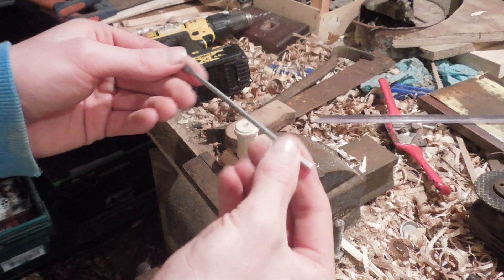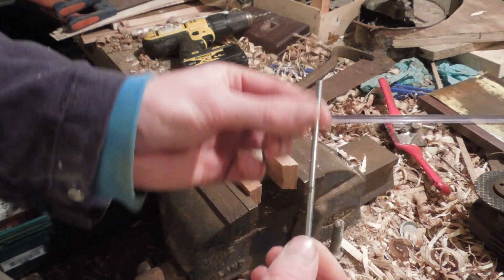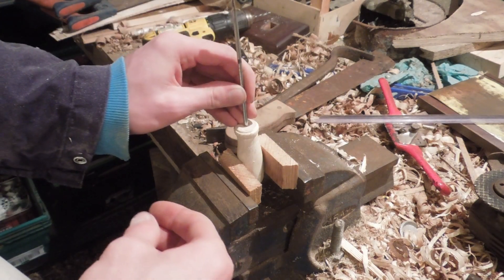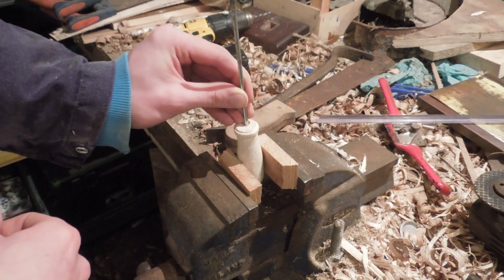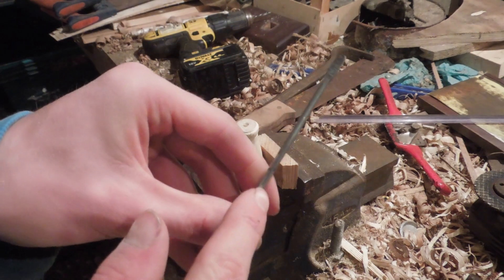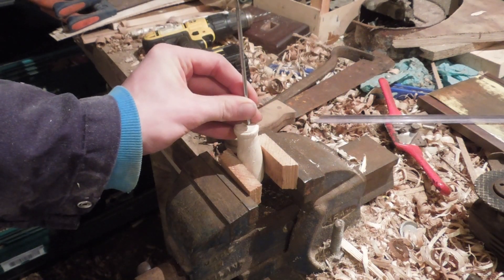But we have a problem. The smooth shaft of the neck of the screwdriver — if we put it straight into the hole and use it as a screwdriver under a tight load, it will just slip; the head will just spin. So I'm going to weld on a little spot just on the shaft, and that'll act like a keyway so it can't spin.